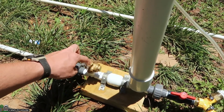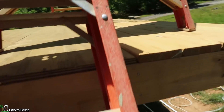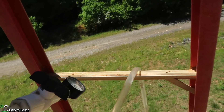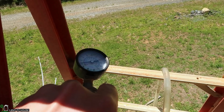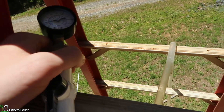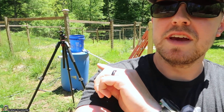I'm trying to get up here to the top before the one-minute mark so that I can open this other valve and see what kind of pressure we're getting. I'm kind of afraid of heights, so this is a challenge for me. I have the valve open here and it's been almost a minute — we're at 20 PSI right now. Now we're at looks like 24 PSI. So it hasn't lost a whole lot based on this lift here, which is pretty cool. All of that was just to show you that a lot of pressure has been built up at the top, even with just three feet of head pressure.